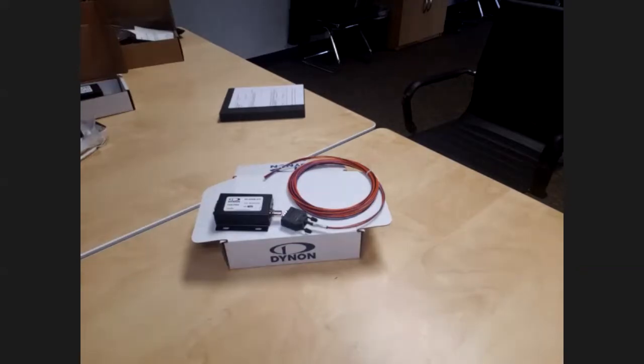Because what is generated for you is a custom puck of traffic around your airplane. So it's basically 15 miles around you, and plus or minus, I think it's 3,000 or 5,000 feet. And that is literally addressed to your aircraft. Other people can see that traffic picture if they happen to be near, but if you want the most complete traffic picture, you want to actually have your ADS-B out, which again is done via our transponder. And then you get it back on the dual band receiver.